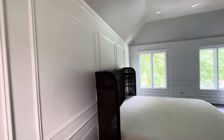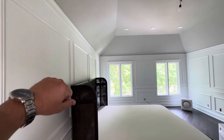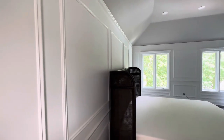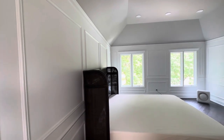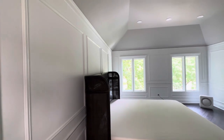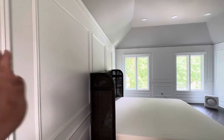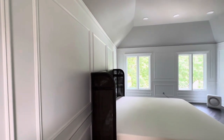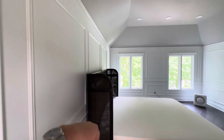So it started off that we were going to spray this from floor to ceiling with satin. At the end of the day, it didn't work out because there was so much wall damage and previous paint jobs. Not too much work, but the cost wasn't worth the effort to skim everything to level five. So the option was we kept the trim all satin and then all the flat parts of the wall we did flat.